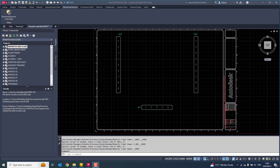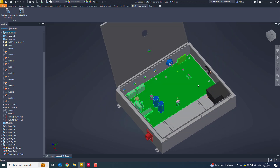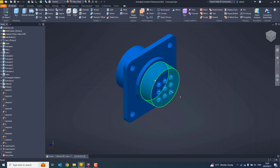First of all, I'm going to go into my AutoCAD Electrical. What you can see over here is I've put down some connectors. These connectors have got pins with their pin numbers — 1 to 9, 1 to 9, and 1 to 5. Those pin numbers are crucial in Inventor. If I come to my components over here and right-click and open, I've created those points, and 1 through 9 will basically link up with the pin numbers inside AutoCAD Electrical.